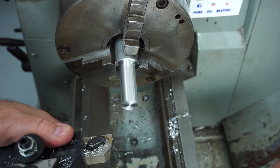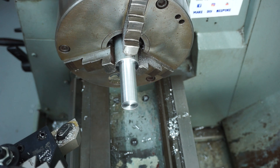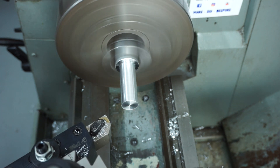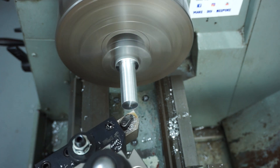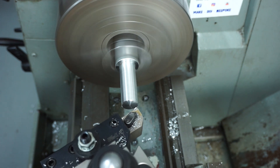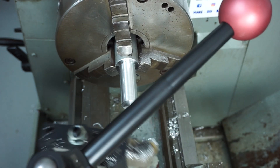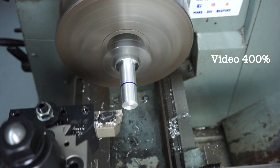Just giving the lathe a quick cleanup so I don't have swarf going everywhere. You'll notice I'm adjusting the tool post - that's the beauty of this Dorian quick-change tool post. I can offset it in 15 increments and run the lathe in reverse, dropping over to the backside to take a light chamfer on the part. Then I'll set the tool post back to zero and start working on the front section.